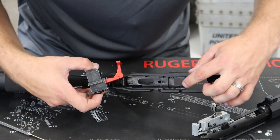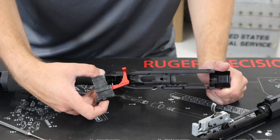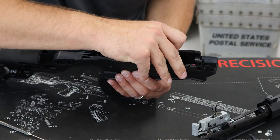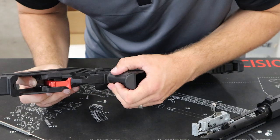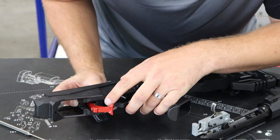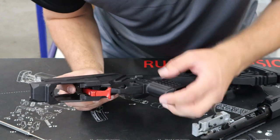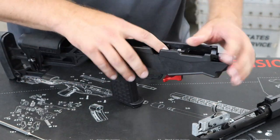Note that there are two slots in this. You're going to want to put this piece in the front slot. Push that plunger, bring it over where the mag goes, and slowly put that down into the first slot. If you look closely in there, you're going to see that the spring is free — the spring did not get caught. That way when you release it, it's going to work properly. That's how it should be properly installed. Come up on top and just make sure it's seated correctly.